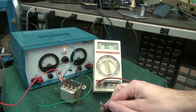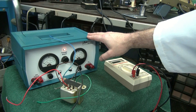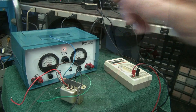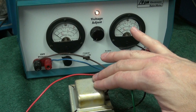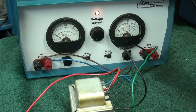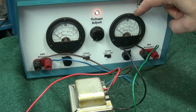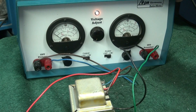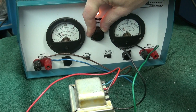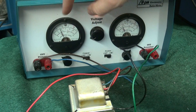But now the best check is to put this transformer on an impedance meter — this is a turns ratio meter. I can look at this transformer and tell you if it's the right one for your Princeton. I have the transformer under test hooked up: the primary is going to the two leads that would go to the plate caps of your tubes, and the secondary — meaning your 8-ohm speaker — is going to this output meter. This meter is set to zero to three volts, and we're going to look for one volt, right about that red mark. I'm going to bring up the voltage until I start seeing output and set my output to see one volt. There it is — about a volt. Looks like I'm about 30 volts on the input, and my scale is zero to 100 volts.